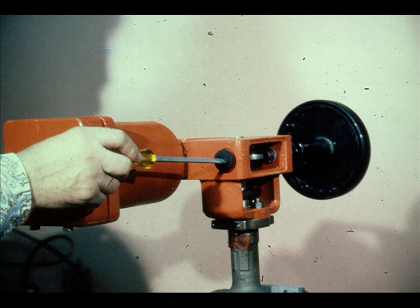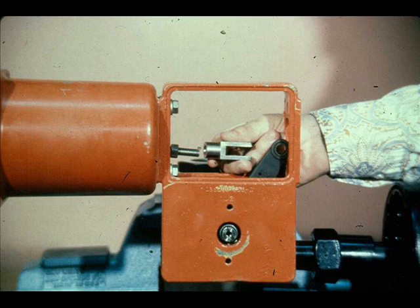Replace the handwheel washer and true arc ring, and back off the handwheel so it will not interfere with the operation of the lever. Replace the handwheel thread plug. If the valve is equipped with the optional limit stop instead of the thread plug, it must now be installed. Back off the stop so it will not interfere with operation of the lever at this time. Since this valve is air-to-open, the clevis must be removed to make the actuator stem adjustment.